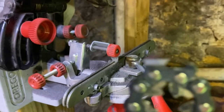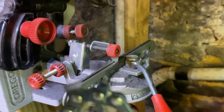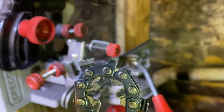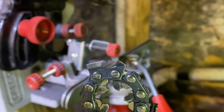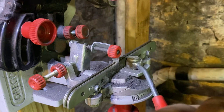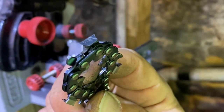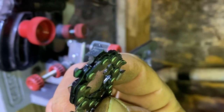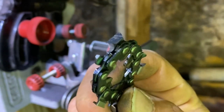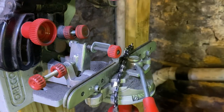All righty. Can you see it? She's a little bit more aggressive on the hook than what some people prefer. That's just my style of sharpening — it's the way I like it. And in the rakers, you can see where she made contact with the top of the raker. Remember the little material removed. But that's it, that's how she does her. Whole chain is done.